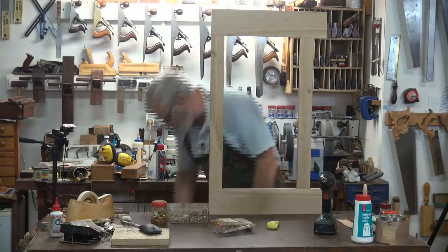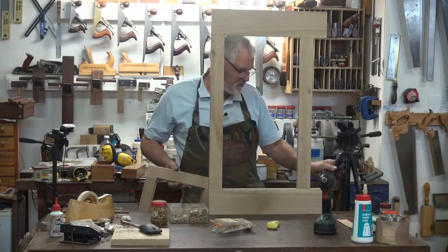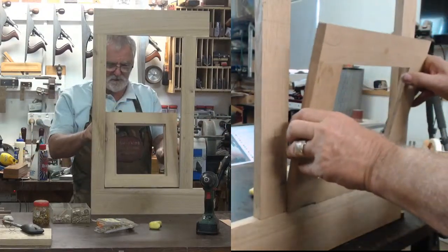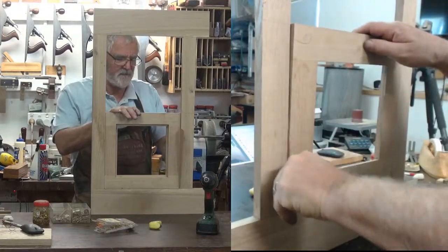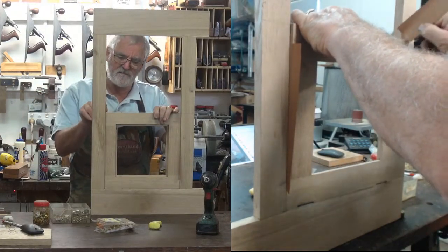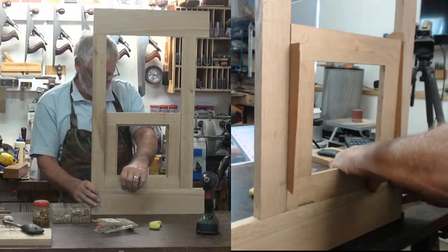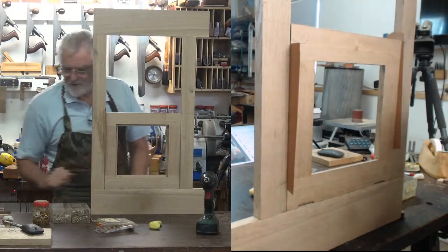All right, so door. I'll bring this around here. The thing with the door is you've got to get it spaced evenly. So what I do is put that down there, and I want an even space top and bottom. You don't want it so it's an interference fit, you want it so it's going to be a nice fit. I can get that in there. There you go. And move this to the edge. Like that, and you see we've got 0.6 of a mil either side.